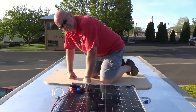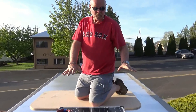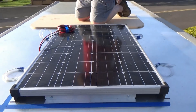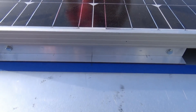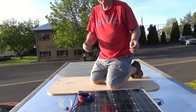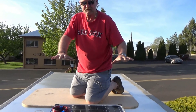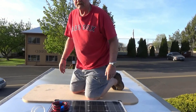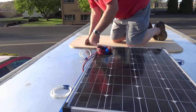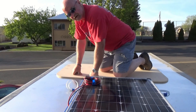We're dry set right now — the tape is on the solar panel and we've got a center line there to mark it and one edge, so when we lift this up we'll peel the film off, set it down, press it in place, and once it's all locked in place we do the safety lanyards and she's ready to create power.